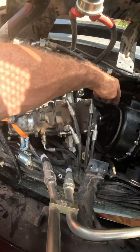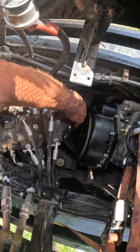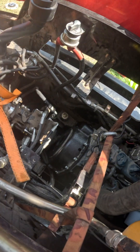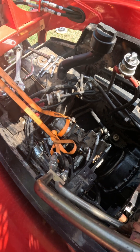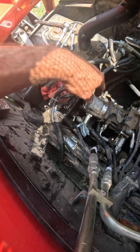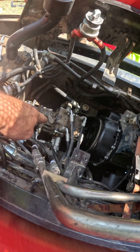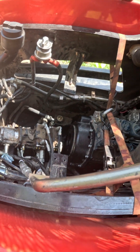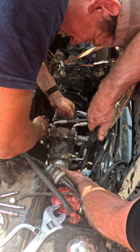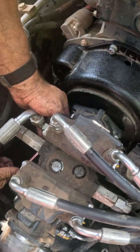We're gonna let you do that, John. They're all in — put some grease on this to hopefully slide right in. We had a strap on here just to get it out of the way so we could get this housing off. Now we're releasing that — the only hydraulic line we had to remove was just too tight. Two lines off of it, didn't lose much fluid at all. Now we're gonna slide the pump into the engine — and she slid right in, she's in.